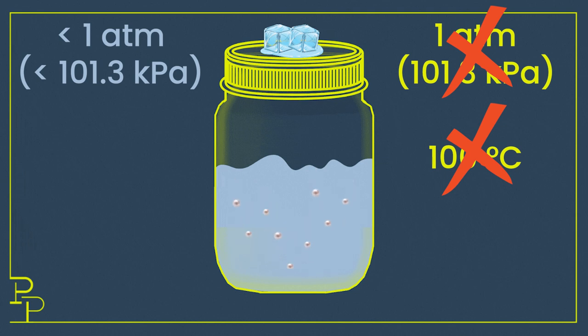The energy it gets from the liquid, so the removal of that energy causes the temperature of the liquid to drop. The entire system sorts itself out so that the amount of liquid that boils off is enough to remove the amount of energy required so that the temperature always corresponds to the boiling point at whatever pressure is in the jar. In other words, you always have the vapor pressure corresponding to the liquid temperature, and the system is always saturated.